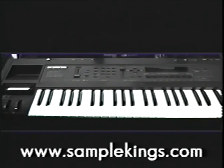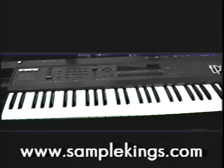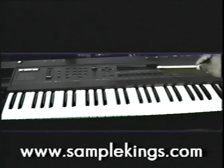Next to our data entry controls is our display panel. Our display panel is divided into two main sections: the indicator lights, which are in the top half of the window, and a 22-character alphanumeric display, which is at the bottom of the window. The indicator lights in the top half of the window tell us what mode we are in, what page we are on, or the status of the sequencer, just to name a few of the functions. The bottom half of our display enables us to see specific files, parameters, and commands.